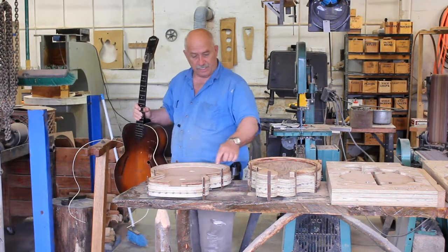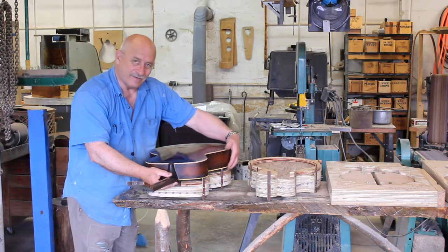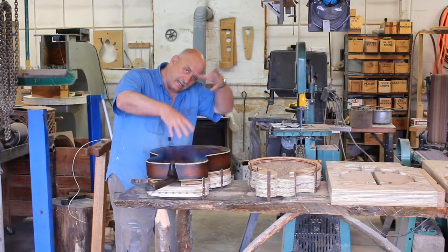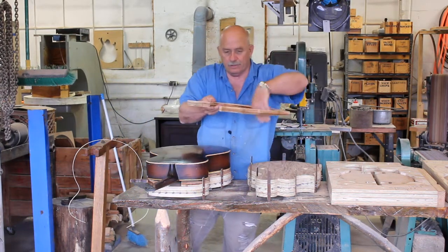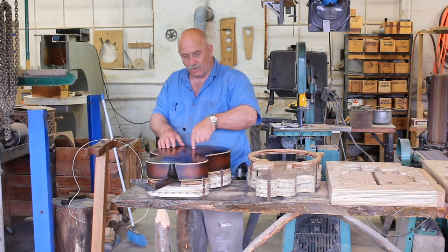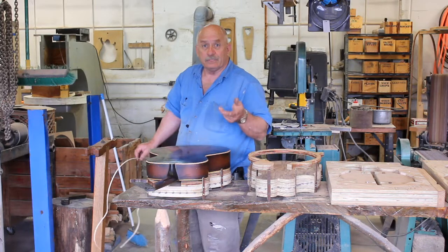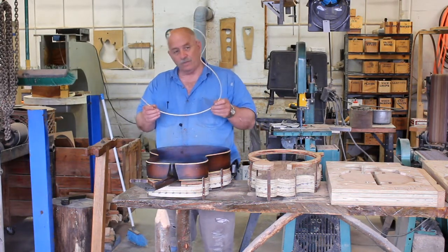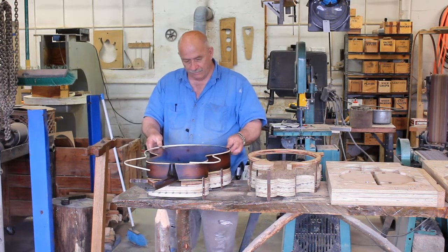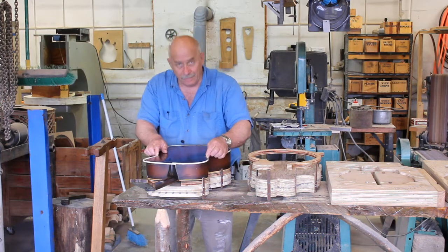So I have a ring that's basically shaped like this and fits down in here. I'll pad the ring with leather strips. It fits down in here almost perfectly — this guitar does, on this Mandicello mold — and then the belly hangs down into that empty hole. The instrument is still steady and level, which is wonderful. This guitar actually fits into the Mandicello binding jig, because from a couple of episodes ago we decided to put a piece of wooden binding on. I bent this binding on our new bender, and now we have a place to put the guitar down, hold it steady, and wrap the binding on and clamp it with string.